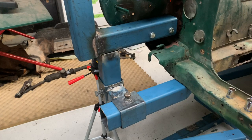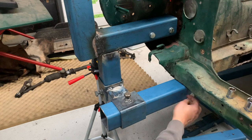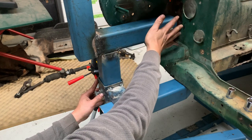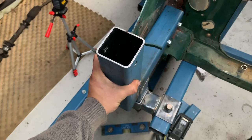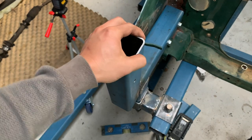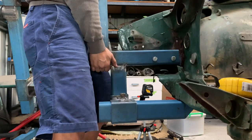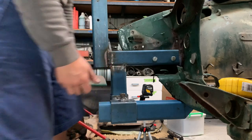This is what I've come up with to strengthen the front mount. I've added a bolt-in point to the forward tow points — there's a tow hook on this side and on the other side for towing the car. I've made it adjustable so that when I repair this front section and the bumper mounts are right, it's still going to be able to fit. Side loading — I'm really putting a lot of force in and you can see it's not moving at all. Applying upward force I'm able to lift the car and you get no movement whatsoever. It's added a lot of strength and I'm really happy with how that came out.